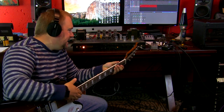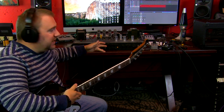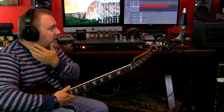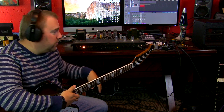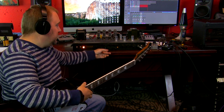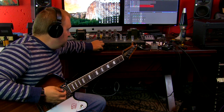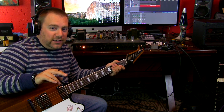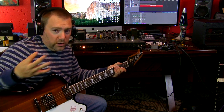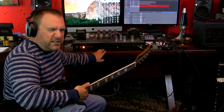Alright, so I have everything cleaned — all of the potentiometers here have been cleaned. And I have it plugged in. Like I said before, I didn't do a before kind of deal, and I don't even have this back in the housing. The reason I didn't want to do that is because I didn't want to have everything powered on. Believe me, if I had done that, all you'd hear would be a whole bunch of pops. In one case, as I was alluding to earlier, my mids — there was a whole section that kind of just cut out a little or gave a weird noise.